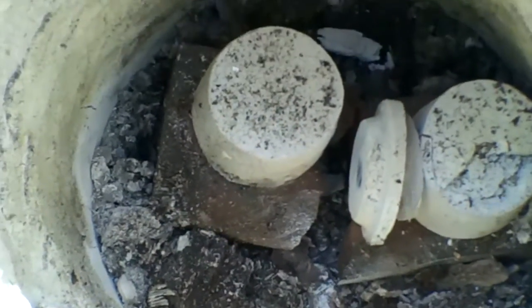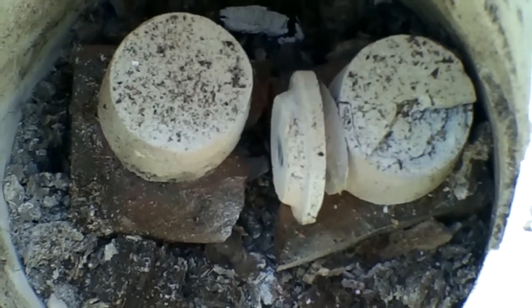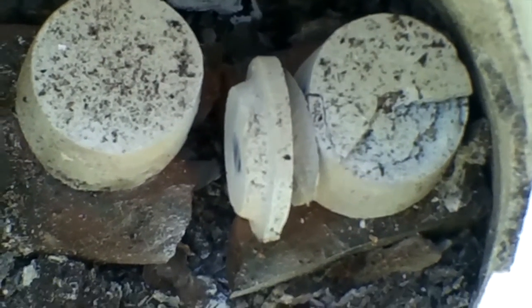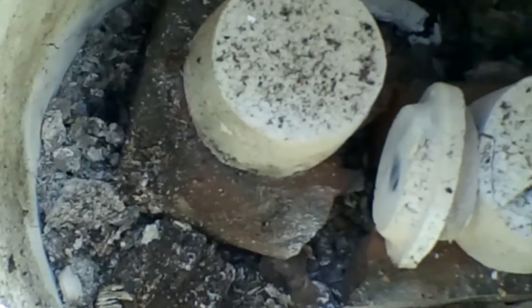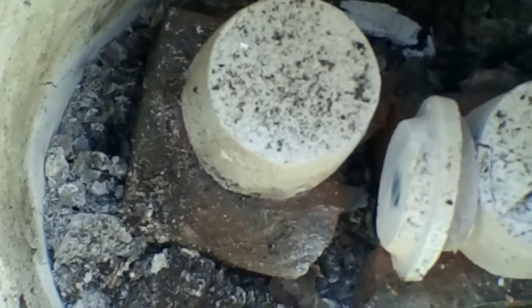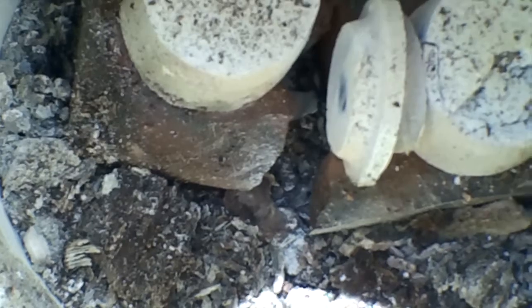The fire burned itself out about an hour and a half on. I let the air run for another half hour. I just turned the air off. I'm going to give this at least 2 or 3 hours to slowly reaccommodate. You can already see that one on the right, it's broken. And actually, I lost the top off of the lid, although the lid itself seems to be intact. The one on the left looks like it's all one piece. I don't know if it'll still be all one piece when we pull it out. Other thing, of course, is the brick didn't like that treatment either. So I may still have something to learn about how you fire graphite clay.